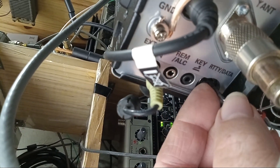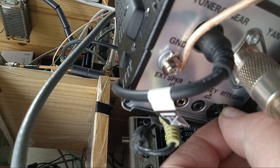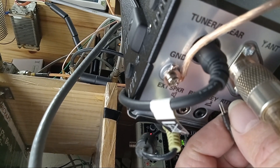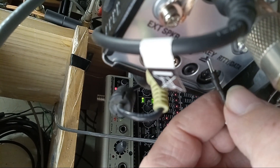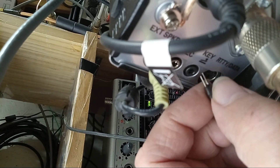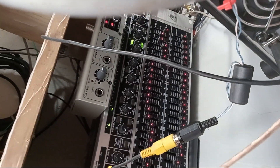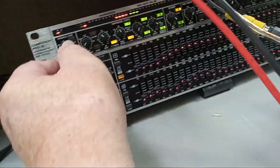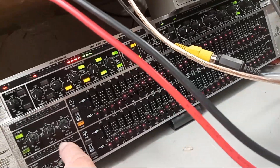There are two pins at the top if you look at the manual. I'll pull this out — I made this. This is an eighth-watt resistor — it's a 4.7k — right here underneath this black shrink tubing. Then there's a piece of that resistor lead which goes to ground, which is the shield. This connects to a cable I made up, and this connects to the output of the graphic equalizer, which is the final stage in my rack.